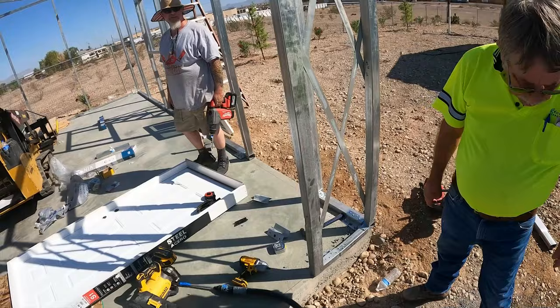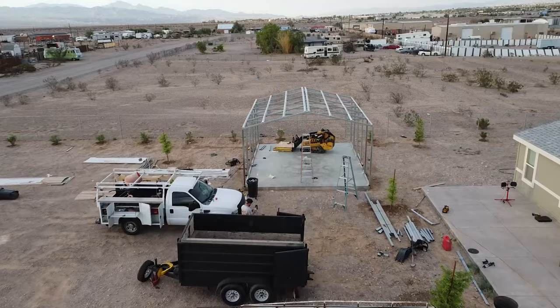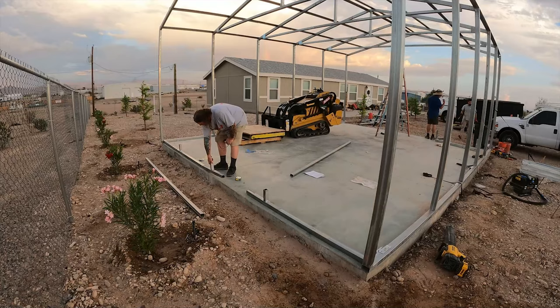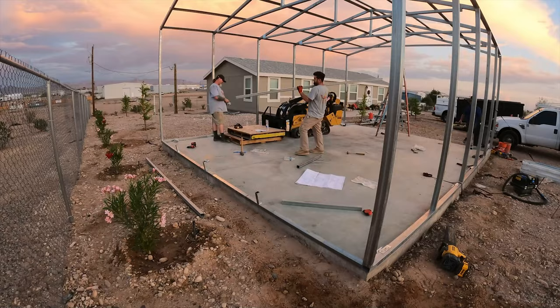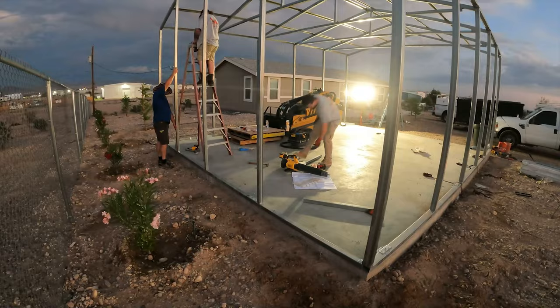This is what it looks like when you've got the framing up. We still need to frame the back wall and the returns on the garage door itself. We also have a little framing for two windows — one on each side — plus a passenger door. The kit comes with all those pieces that make the enclosures for the windows and doors to fit in. It's a really simple, nice system. For the back wall we're at five foot spacing, so we just slip them in and they button up right at the bottom of the truss.